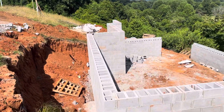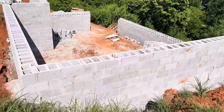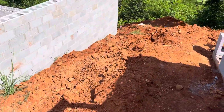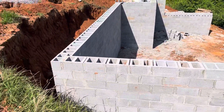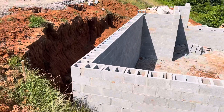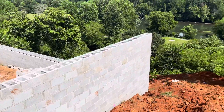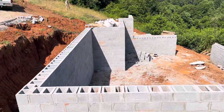This is pretty much what we got done here. We left these blocks open so we can put concrete inside the block. That's kind of how we do these to make the walls much stronger. It's just easier to pour concrete in them when you can leave the top block off the FHA cap, so we can just pour the concrete right down into the holes. That's what it looks like.